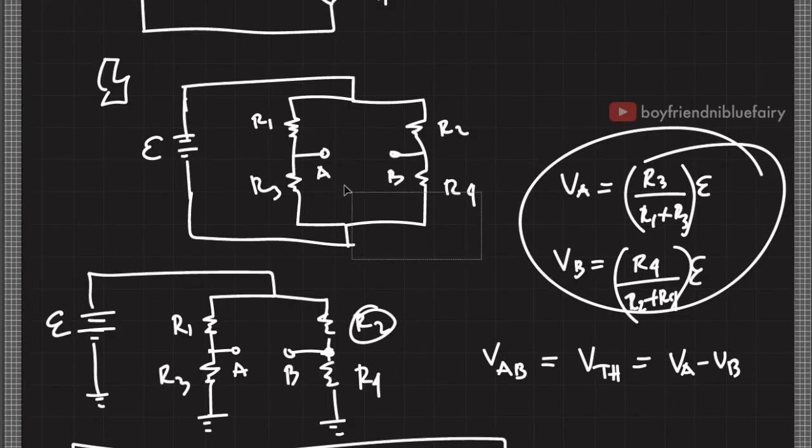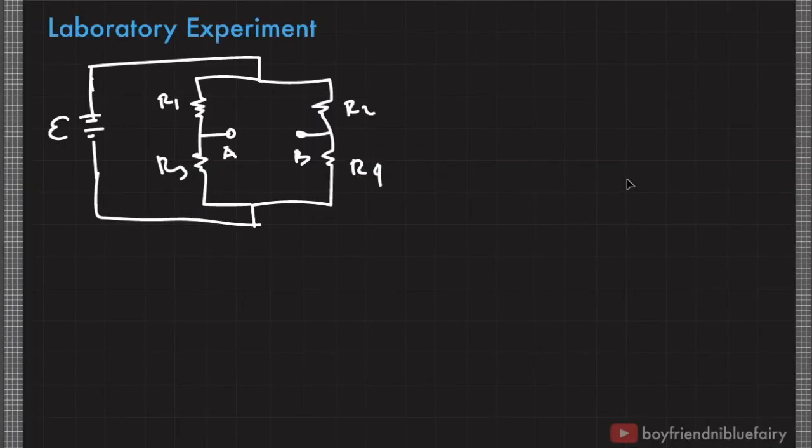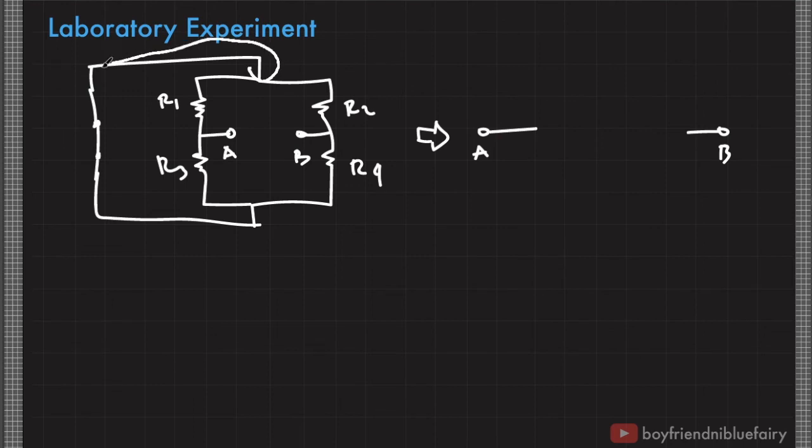So I will copy this figure. Now, when we calculate the equivalent Thevenin resistance, when we have an independent source like this EMF source, we replace it with a short circuit. In other words, I'll just replace this with a simple wire, a short circuit. So from the point of view of points A and B, I'll try to transfer this connection outside and then this one to this side. Notice that this length of wire, I could just put this inside.